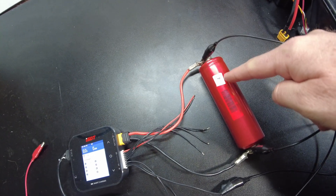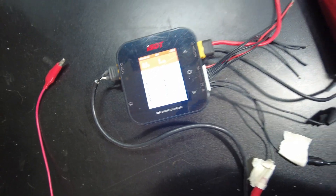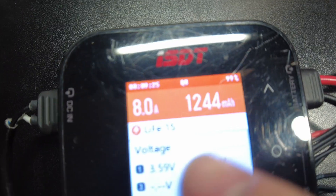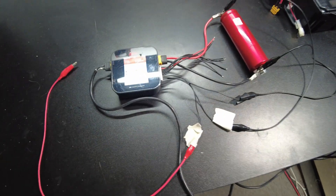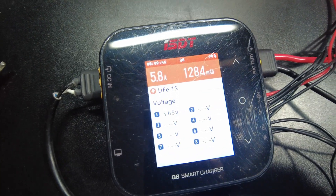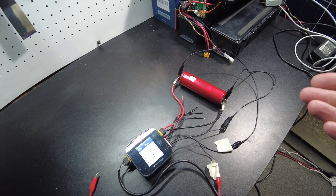We've stopped the charge. We've got the one cell that was not fully charged set up by itself on the charger — it's sitting at 3.34 volts. We're going to charge it and see how much power we have to put into it. We put in 1.25 amp hours, which is slightly worse than the 24-hour balance result. Now at 3.65, that's almost 1.3 amps — pretty much the same result, actually even slightly worse than the 24-hour test. Going seven days did not make these balance.